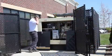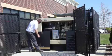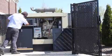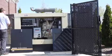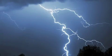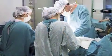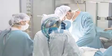After testing and carrying out any adjustments and/or repairs, our technician will run up the set to ensure everything is operating as it should. Remember the importance of including battery and battery charger maintenance in your planned maintenance schedule. A power outage is not the time to find out your battery should have been charged, especially on a standby generator system installed to protect a critical life or economic system.